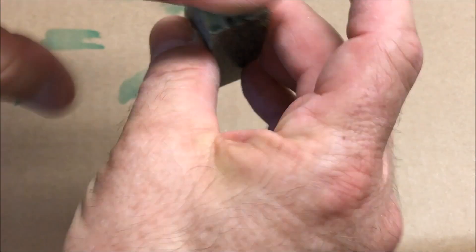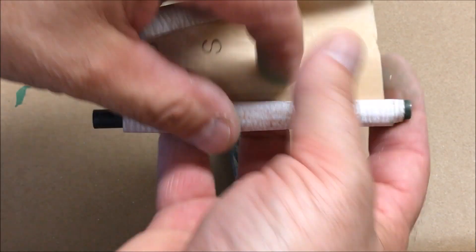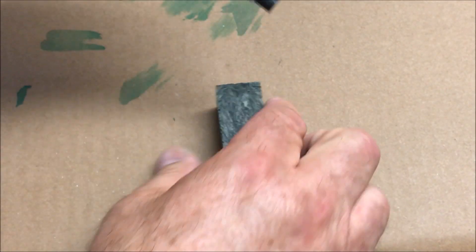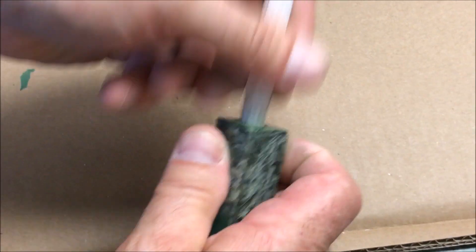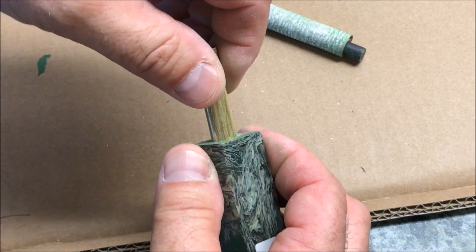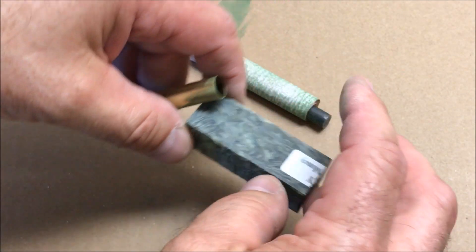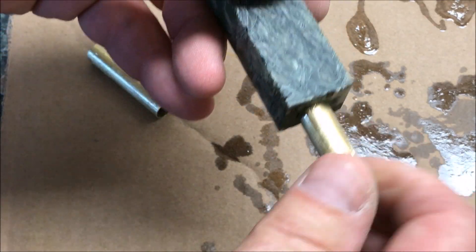This side is going to go down in there — let me push it out and re-roll the sandpaper the opposite direction. I think I've still got a bit of obstruction there and probably what it boils down to is I put the paint in pretty thick with the q-tip and on one side there was a run causing the issue. I'm going to shut the camera off and continue this process, rotating the sandpaper to keep a clean piece on the punch, until the tube can freely slide into this blank. It took a couple more passes but you can see the tube can now go into the blank — it's a little tight but the CA glue will lubricate it and allow it to slide in easier.